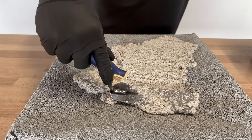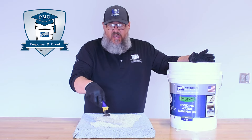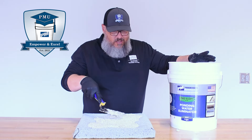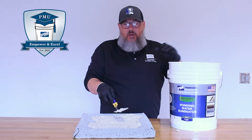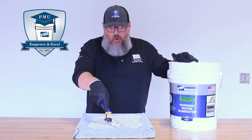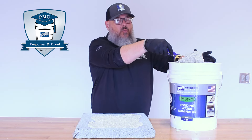The thing really to be aware of is the cure time. Before you can top coat this, it needs to be cured all the way through. I would allow on average about 48 to 72 hours with average humidity. If you're down in Phoenix or other really dry climates, you're going to need to let it cure for probably three to four days before you can top coat it. If you top coat it before it is cured, it'll give kind of a wrinkled look in that area — it won't affect performance in any way, shape, or form, but it'll just look really funky.